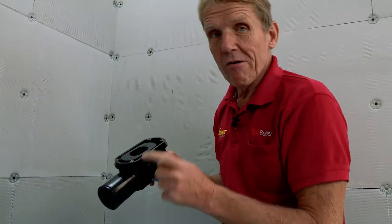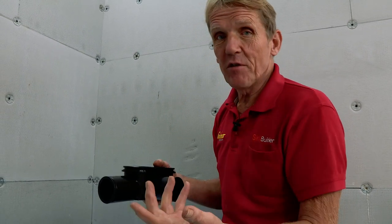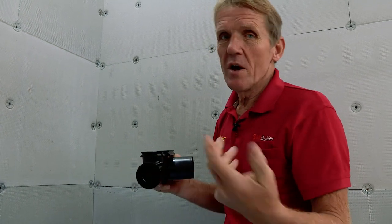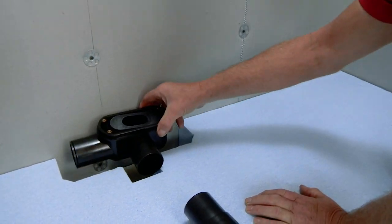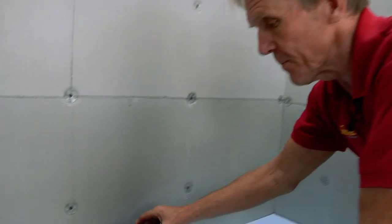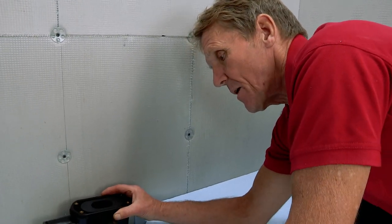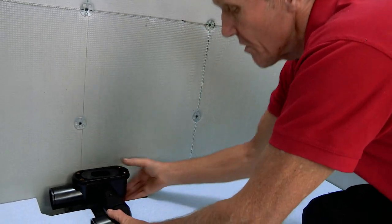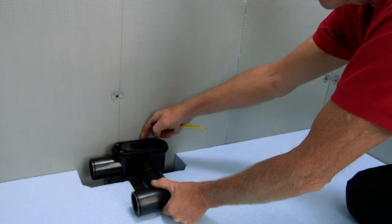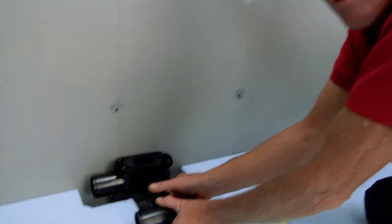This trap is multi-directional and more than that - you can reduce it down. It's provided with a reducer and a stop end so you can take it down from 50mm to 40mm. At 50mm (2 inch) you've got 42 litres per minute flow rate. If you reduce that down to 40mm (inch and a half) that reduces it further, so work out what shower you're using and how much capacity you want. I'm going to reduce this down, add the elbow, and mark out where that pipe is going to go. You can have the extender on or take it off and bring it in tighter. Don't be too tight - leave yourself a little bit of leeway because you want about 8 millimetres off that back wall.